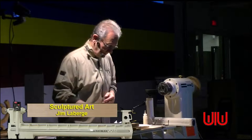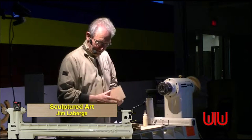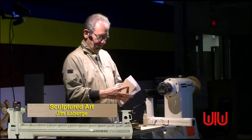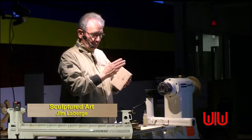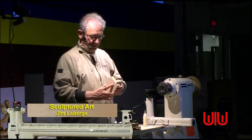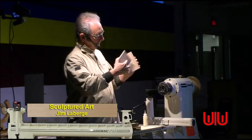So, if you're going to make a paper joint, it's a sandwich. Wood, glue, paper, glue, wood. So I have here wood and newspaper. Okay? So I'm going to make a sandwich like that. Now, the two surfaces that you're going to join should be reasonably flat because you want the contact between the wood, glue, paper, glue, wood to be fairly consistent. So I just picked some pieces out of a pile at home and they were a little bit curved. But the two curves in this case match, so I'm just going to demonstrate how to make a paper joint. So I'm going to paper here and here. These are the matching surfaces.